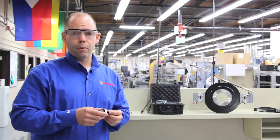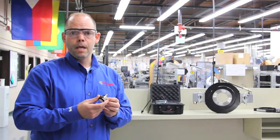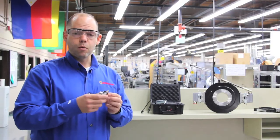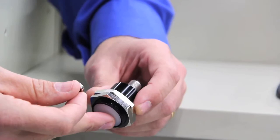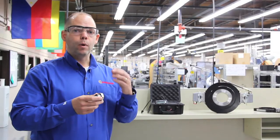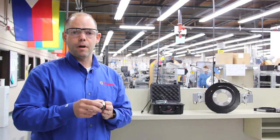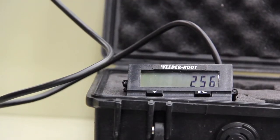Which brings us to what we're going to talk about today: the HDP-30 series of non-contact position sensors. What makes this product interesting and suitable for these applications is the way that it's built. The product is built in a standard 30 millimeter housing, which is common to the industry for speed and position sensing when it comes to proximity sensors. However, we've basically embedded special electronics in here to behave like an encoder to give us true absolute or incremental output.